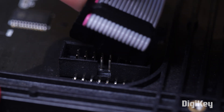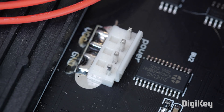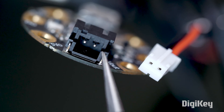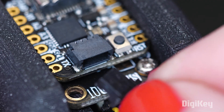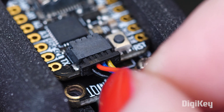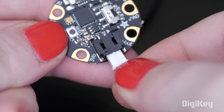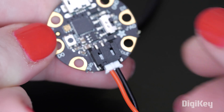Wire-to-board connectors are just custom-shaped pieces of plastic holding a particular configuration of headers and sockets. The distance between the pins is called the pitch, and there are many standard configurations, such as those designed by JST, or Japan Solderless Terminal Manufacturing Company. They are differentiated by their type — for example, JST PH — then also the number of pins and the pitch.